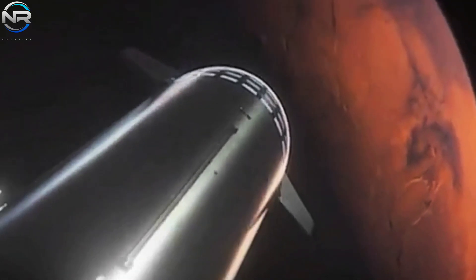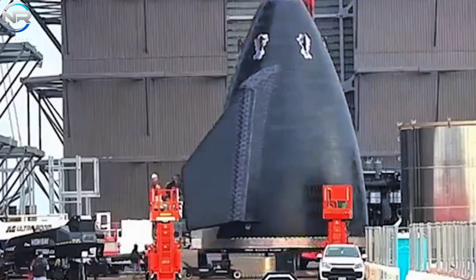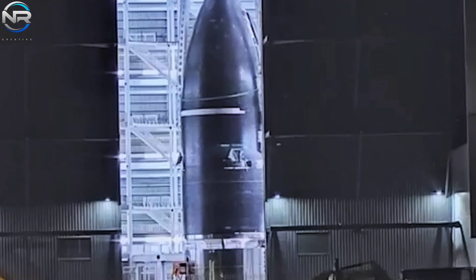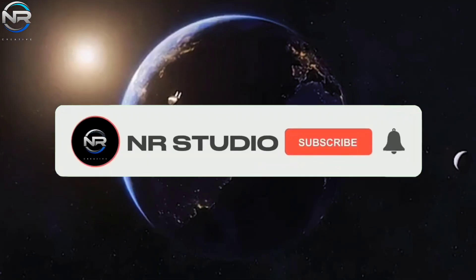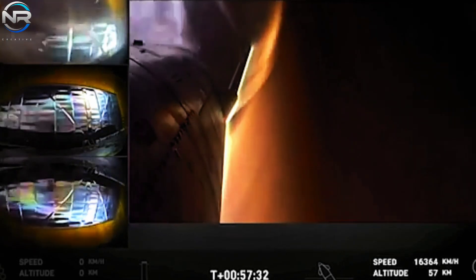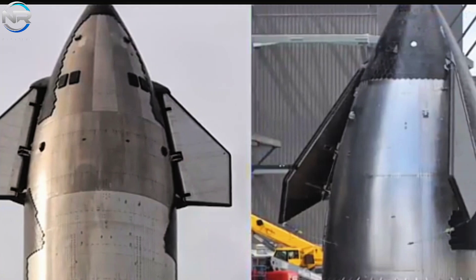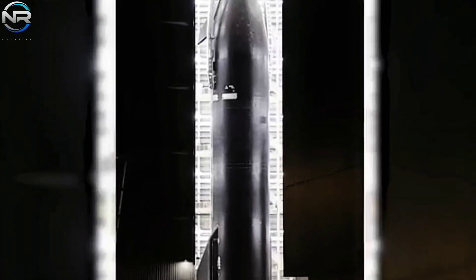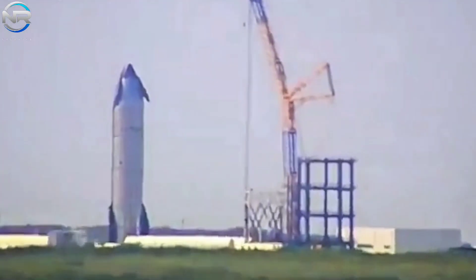Promisingly, the initial prototypes of V2 demonstrate substantial improvements. A side-by-side comparison of the nose cones from V1 and V2 highlights a considerable advancement. The welds on V2 are virtually imperceptible, giving the perception of a cohesive, unified entity. This simultaneously indicates enhanced durability and underscores advancements in welding technology. However, durability constitutes merely one aspect of the overall equation. SpaceX is committed to the principle of reusability, aiming to enable their rockets to undertake multiple flights. Advanced welding techniques will be instrumental in realizing this objective as they mitigate structural stress and optimize refurbishment processes. An additional significant benefit of the innovative welding techniques lies in their enhanced speed. The substantial enhancement of automation has resulted in a remarkable acceleration of production timelines. The inaugural prototype of V2, designated Ship 33, was conceived and constructed in a remarkable span of merely 42 days, underscoring SpaceX's steadfast dedication to operational efficiency.